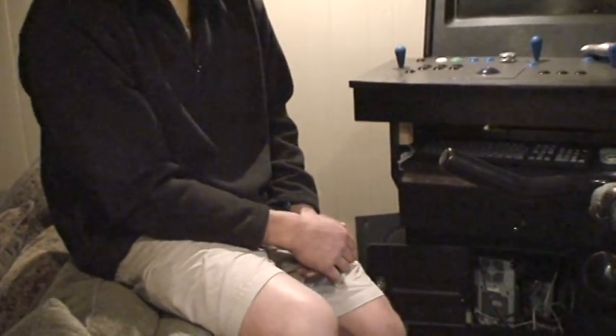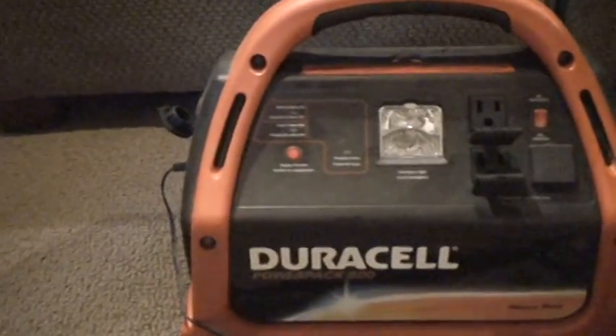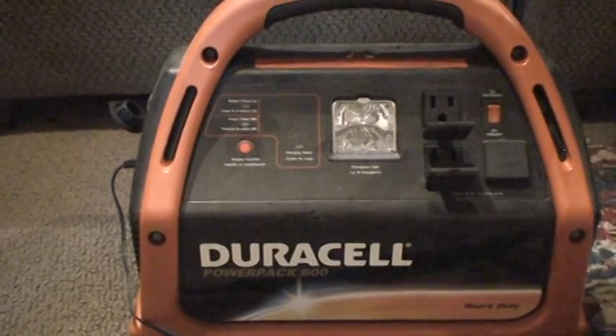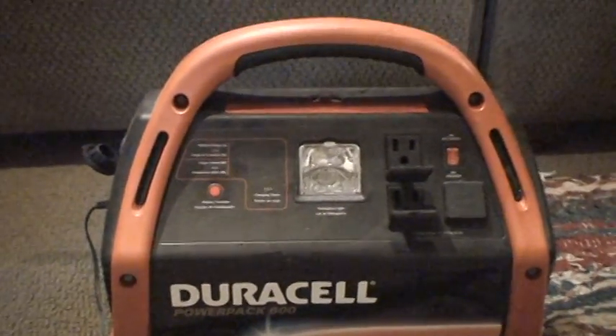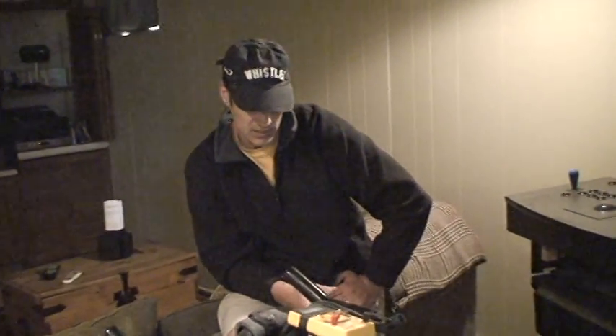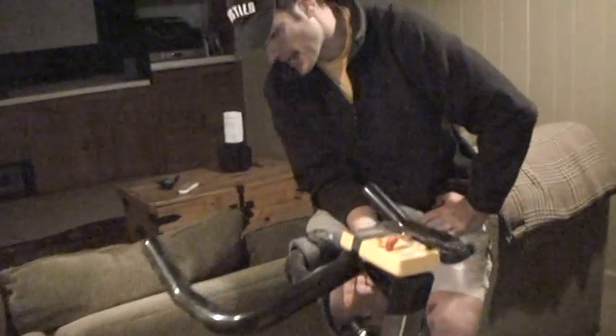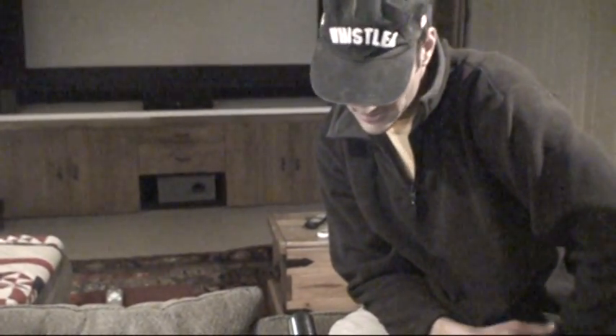The motor runs up to a junction where I have a multimeter patched in so I can monitor the amps and voltage. With the current battery pack it's not as important, since this one seems to have its own voltage regulator installed — it has surge and overvoltage protection. The other battery pack doesn't have that, so it's nice to have a multimeter, because when you start pedaling faster you're pushing upwards of 20–30 volts. I believe this motor is a fairly high-voltage motor, possibly around 120 volts.